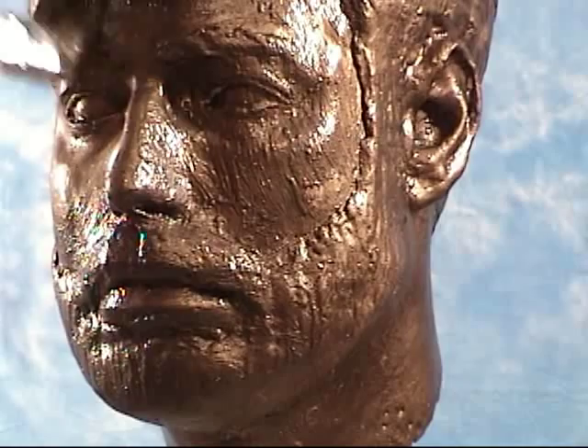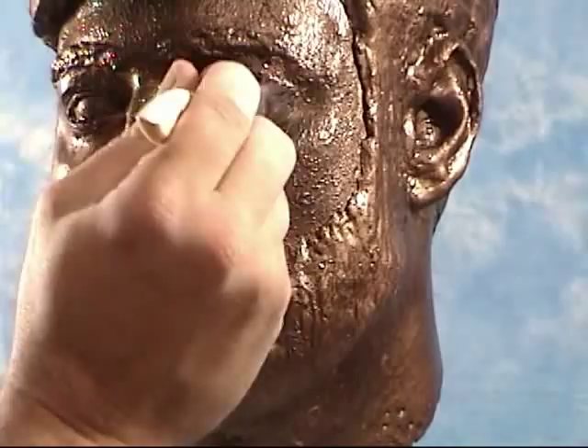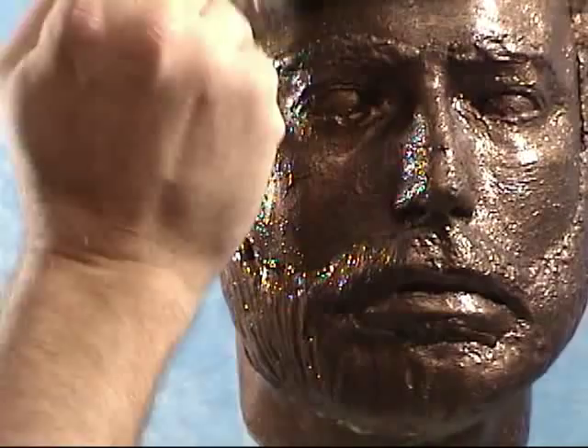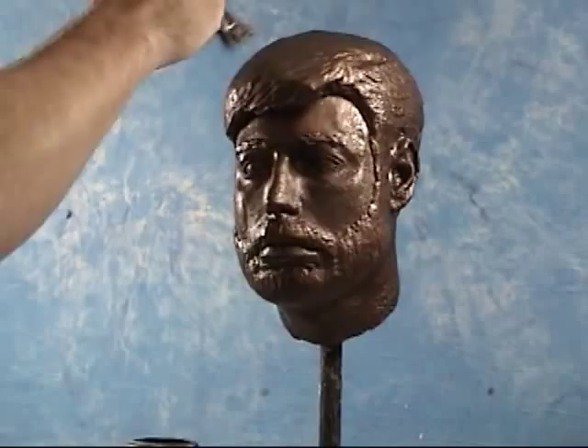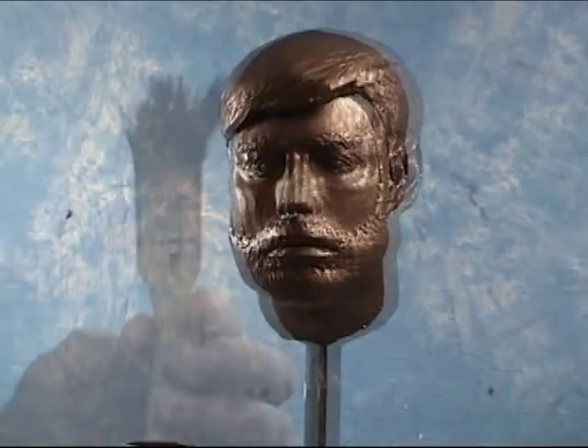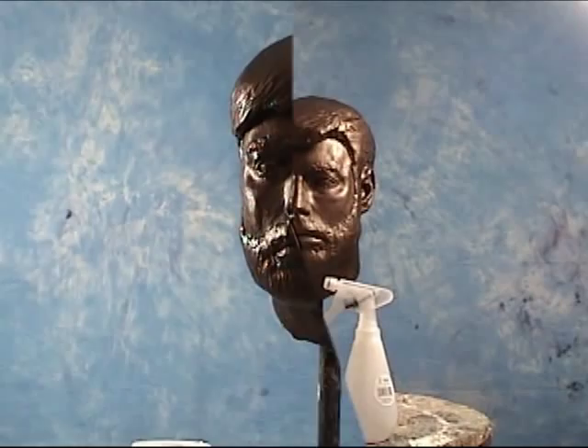Once we brush that all over the surface, we're going to come back in and remove our brush strokes. I do this by stippling the surface with the brush to get rid of those brush strokes and get a slightly textured effect. You could also use a natural sea sponge, a paper towel, or a brush for different looks and textures. Just keep in mind that doing this will ruin the brush, so a lot of times after a coat like this, that brush goes to brush heaven.